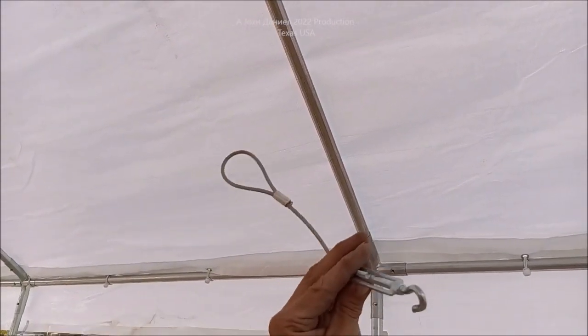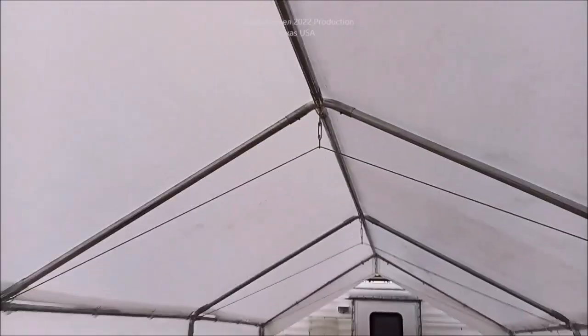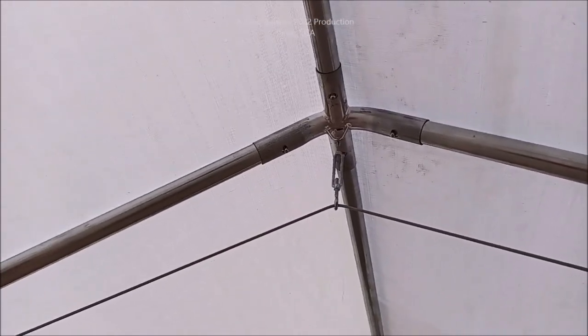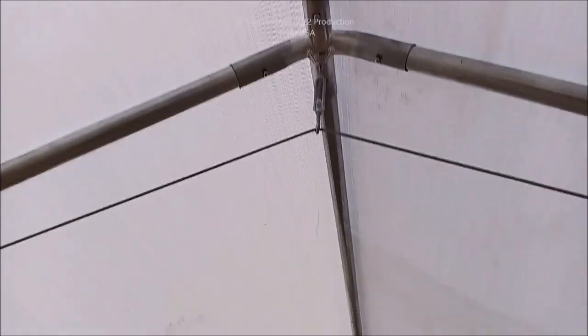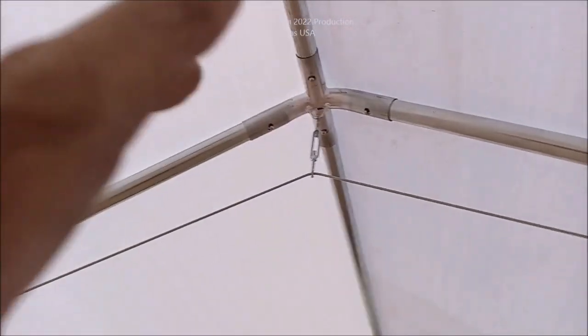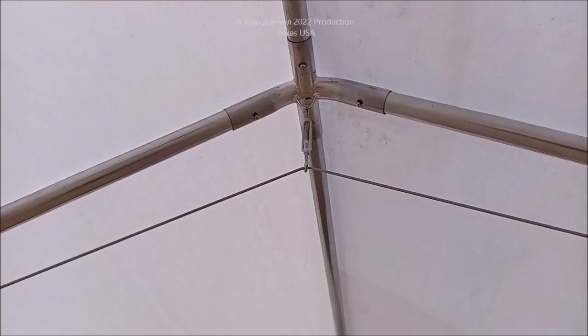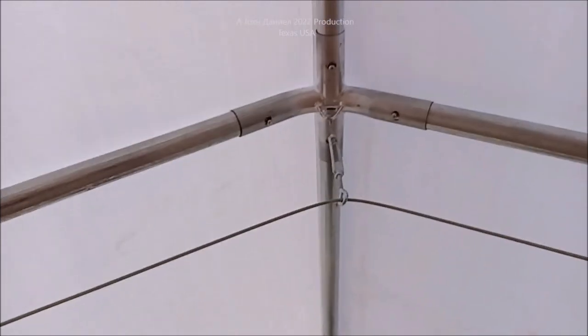The carport is up. I want to give a little critique: the weakest thing I find is the turnbuckle. I recommend that once you tighten it up, you take some bailing wire and run it between those two points right there to lock it in place. I had one crack on me — it didn't break all the way through, but it cracked. So make sure that is done.